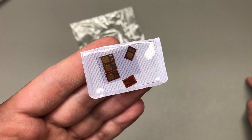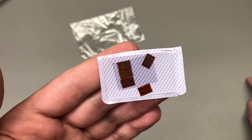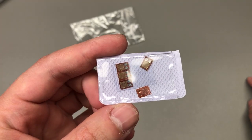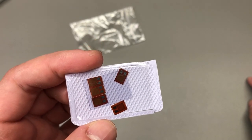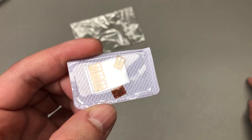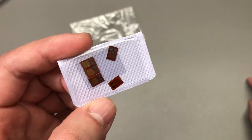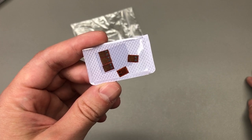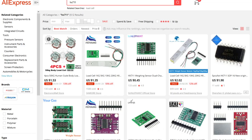My next item is a set of very small precision strain gauges or load cells; the part number is BF350-3AA. Unfortunately, sellers on AliExpress do not provide the full part number in their listings, so it will be difficult to build anything precision-wise from AliExpress sourcing. You can search for a datasheet but you'd want the manufacturer's details to find the exact thermal compensation coefficient, for example. For hobby use and experimenting with this type of measurement they will work fine, and the best bet is to connect them to a bridge measurement circuit like the HX711, which does all the amplification and conversion inside the chip — you can also source those cheaply on AliExpress.